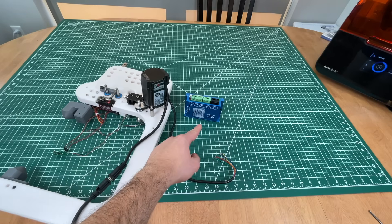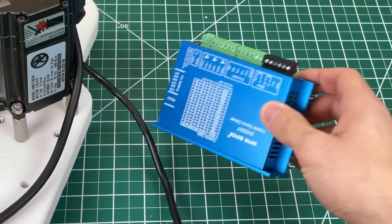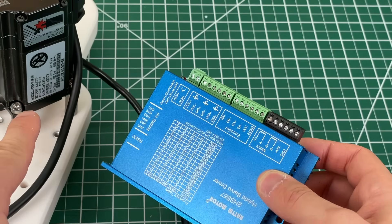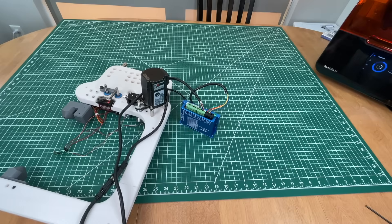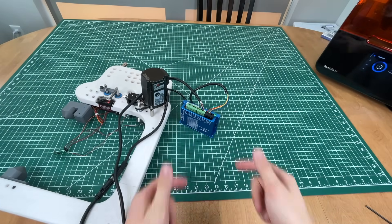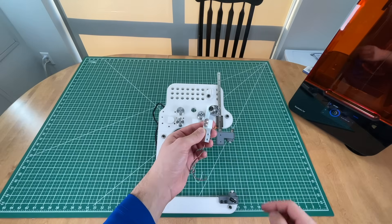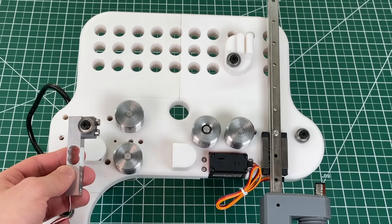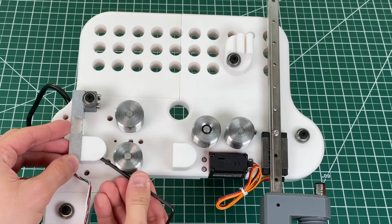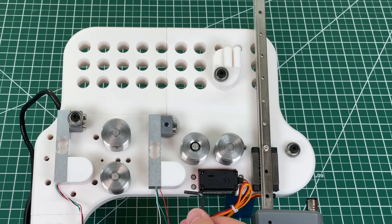Let's quickly connect the motor to the driver — this is super easy because the motor tells you exactly which wire by color connects to which terminal on the driver. We connect the four motor wires followed by the six encoder wires and we're ready to move on to our tension sensors. These sensors will dynamically inform our controller of whether the wire is tight enough or not, which will engage the brake accordingly to increase or decrease the brass wire tension. We mount these with just two M5 screws and we have two of these sensors — one for the respool mechanism tension and one for the cutting surface tension.